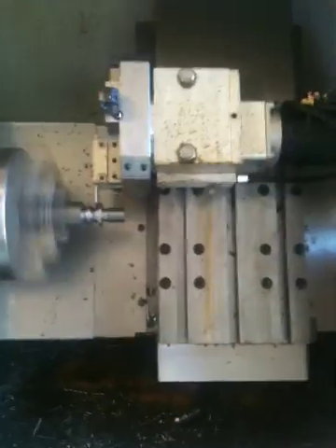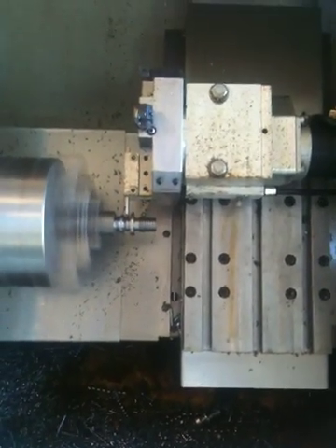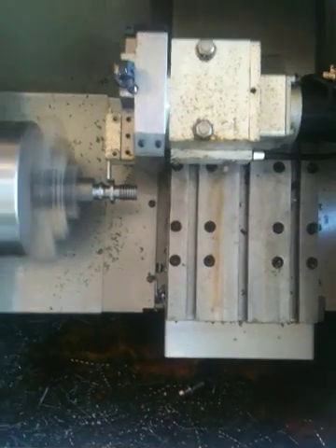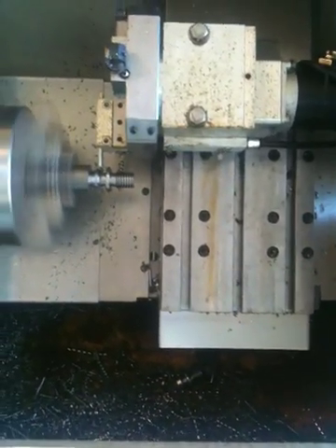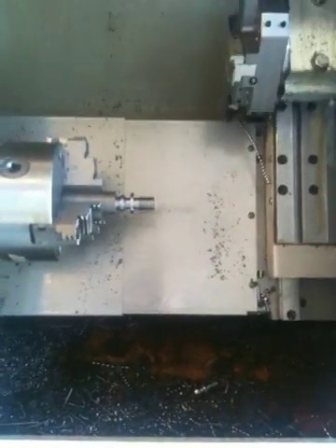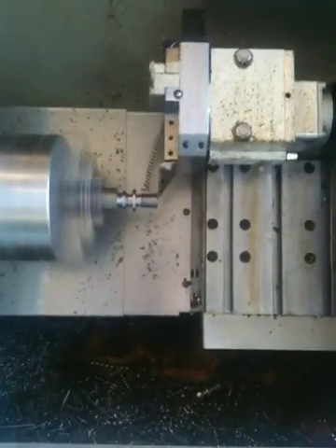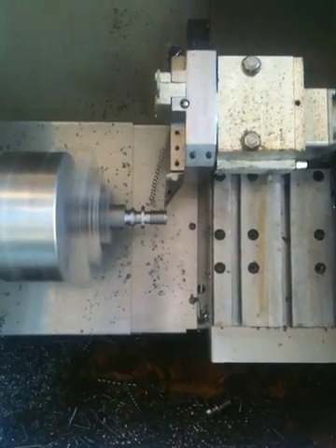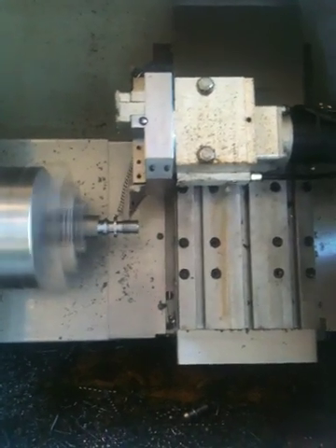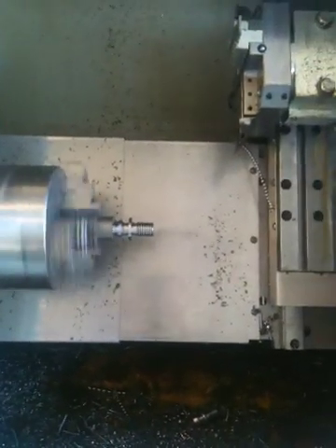This tool here goes back — it's a cut-off tool that goes behind and takes out some groove material behind the wall of the bore. Spinning at 750 RPM, it goes in and takes a pass back there, where the balls of the pull stud engage. Then it indexes to tool 3 and takes a spring pass over the threads. After that it indexes to tool 5, which is the cut-off tool again, and it parts the piece off.